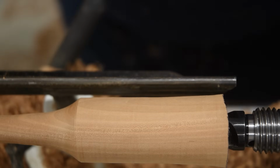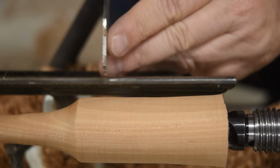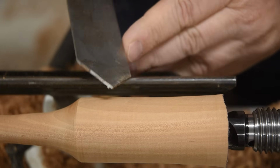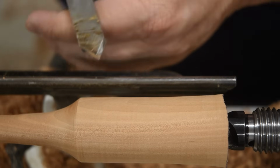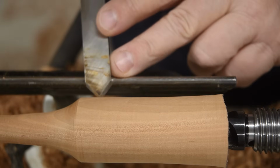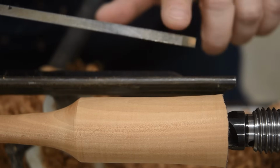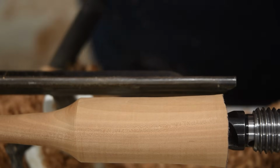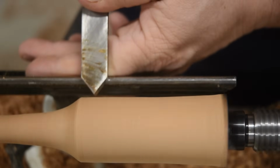If you wanted to, you could use the other parting tool, which we sharpen the same exact way, just touching it at 40 degrees, and make thinner gouges. I'm going to use this one right here just for the sake of it. Or if you wanted to, you could use this tool as a scraper and actually come up, lift up the back of the handle. So it is negative, see, negative, and then just make little indentations using that corner right there. Maybe I'll try that for you. So I come over, few indentations.